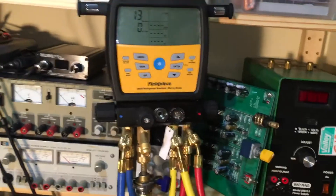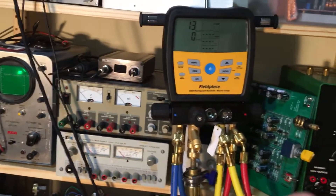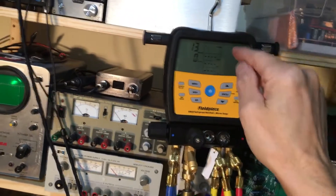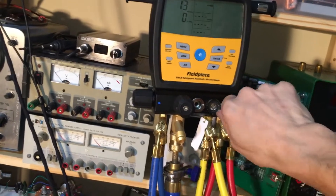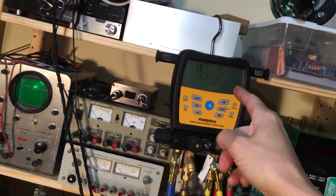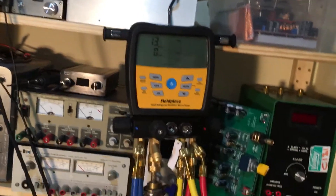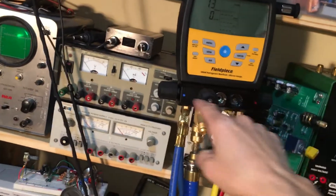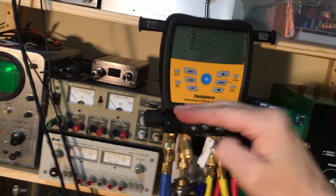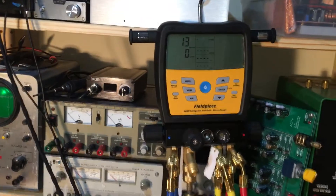The time is about 7:35 PM on Monday. We're at 13 microns and holding, with no valve screwed down tightening this — it's only held in under vacuum pressure. Tomorrow morning around 6:30 or 7, I will take a video of this and let's see where it is. This could not happen without adding silicone grease to a set of gauges. Right now this is about as good as you get — holding and not moving — only after doing the modification process of adding silicone grease. Let's see what happens tomorrow. See you guys.